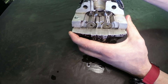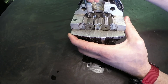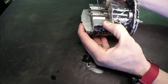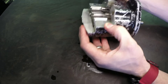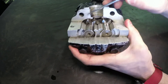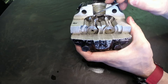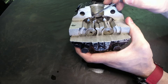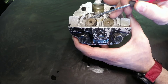The volumetric efficiency of a gear pump is always limited by the gear end clearance. We have high pressure plates that try to squeeze the gear teeth on the ends to increase volumetric efficiency, but as the pump wears out, the gear teeth ride into the housing and eventually gear end clearance increases, causing volumetric efficiency to go down.